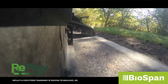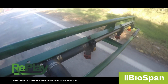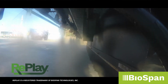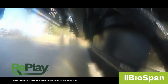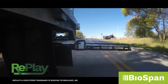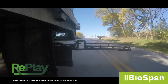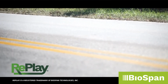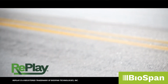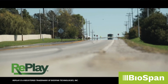Just like stale bread, oxidized asphalt loses its flexibility and strength, which leads to cracks, potholes, and that annoying raveling you see on the surface. And it's not just an eyesore either. These issues lead to costly repairs and a much shorter lifespan for our roads. We're talking billions of dollars in repairs, right? Absolutely, billions. And we've been trying to combat this oxidation problem for ages. There are traditional methods like sealers and petroleum-based rejuvenators, but they're kind of like putting a Band-Aid on a broken bone. Temporary fix, not a long-term solution.